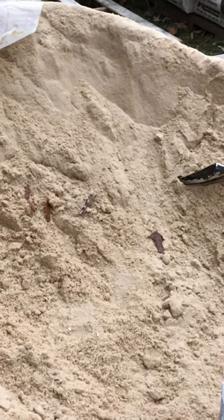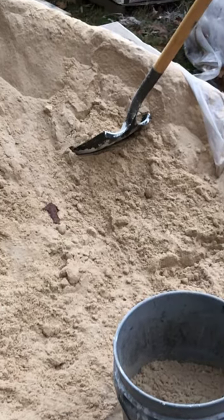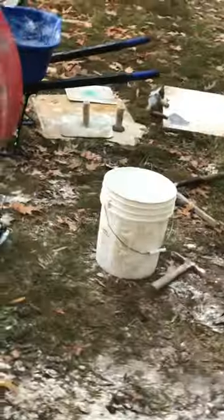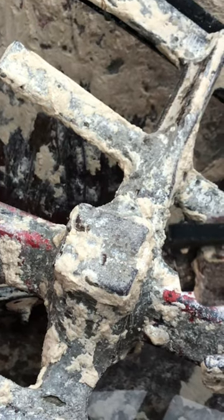And you can usually tell from the sand and the water about how you're going to finish out. Once you add that really dry 5 gallon bucket full of mortar and hydrated lime, what you'll end up with is it'll wick the moisture out really quick, and it will actually stall your mixer out if you don't have enough water. So we always, as a rule, keep a bucket of water really close to the mixer and then immediately start trickling in very slowly, allowing the mixer to use the water. We'll trickle it in really slowly.